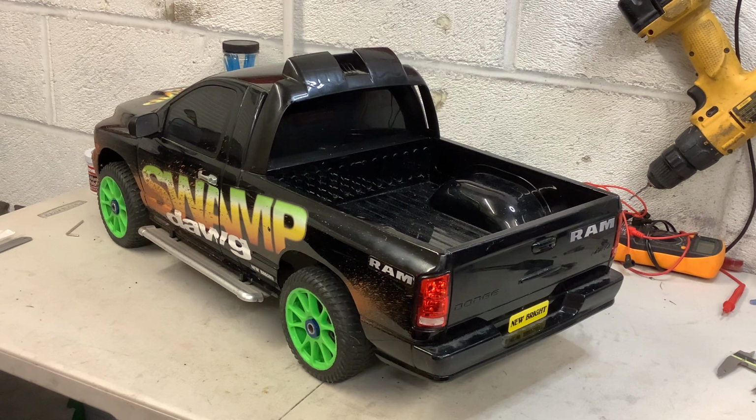The pulley on the cam can go on both ways. You can put it on the wrong way round and have it 180 degrees out. But I had a word with Dennis Dempsey, and he said that on the end of the cam there is a tiny little mark, which I can see now, and I did have it round the wrong way. So if anyone else builds one of these engines, check the cam has got a little mark on it, and that's got to line up with the mark on the pulley and the mark on the crankshaft. So thanks to Dennis.